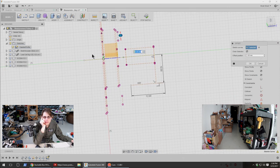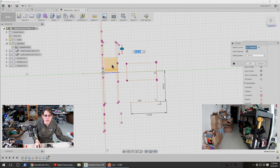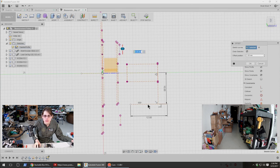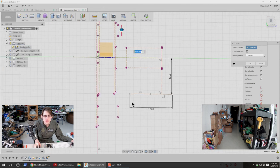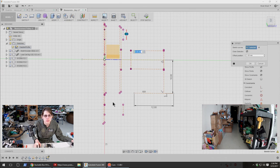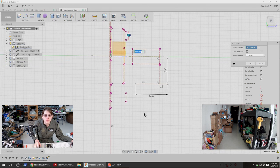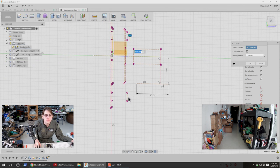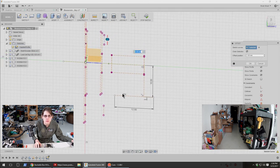I guess part of this is I'm thinking about whether it's worth trying to, again, move this to be more in line with the bearing. Because ideally, the location where the force is pulling toward the ceiling, which is pretty much halfway in between the two loops, right about here, should be way back here on the bearing. But then that means making this wider so I can sit it farther back, and then I have to do something else to get the mechanical connection to these screws, which seems like a huge problem.